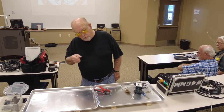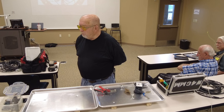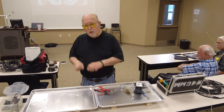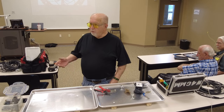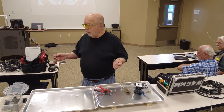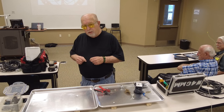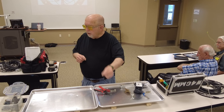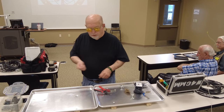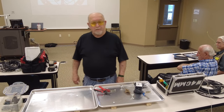So I went to the hardware store and bought an 8-10 inch 1/8 inch bit, and I drilled through the corner of the aluminum frame. I went down to the bar and got one of their little plastic straws and put that in there. Then I went to Radio Shack and bought a roll of 30 gauge wire wrap wire, wrapped some solder on the end of it, fed it over the side, and hooked it up to my tuner. That's how I operated the whole time I was in Atlanta.